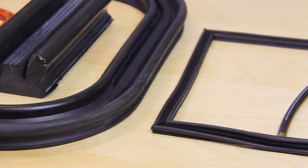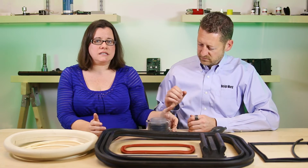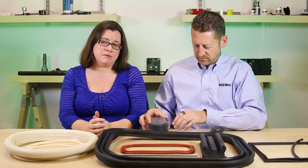Designed with unique cross-section geometries, these seals can inflate and deflate in three basic directions of operation: axial, radial in, and radial out. In this simple demonstration, we will use the integral molded connector to inflate the seal and make an airtight hold on the plastic ring in the radial in geometry.